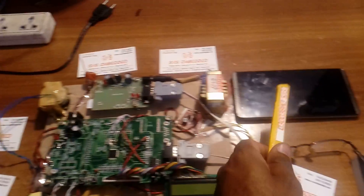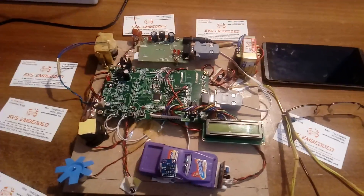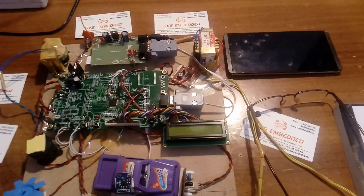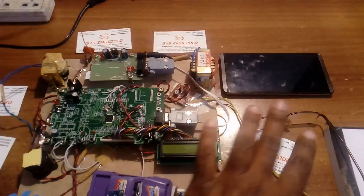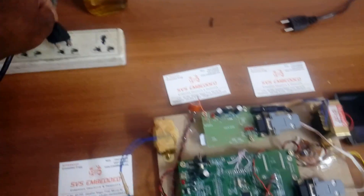When nothing happens, the engine is continuously on and the alarm is off. If any of the five sensors triggers an event, the engine stops, the buzzer activates, and latitude/longitude data is retrieved and sent via SMS to a predefined number. For an obstacle, only the buzzer activates. For an eye blink that is closed for two seconds, it captures latitude/longitude and sends the SMS. Now I am going for the working demonstration — giving the power supply.